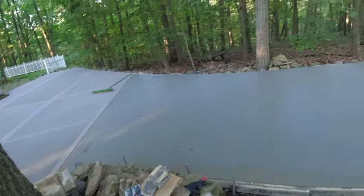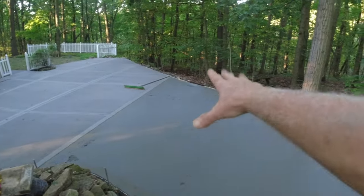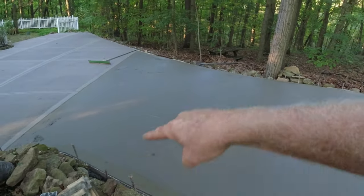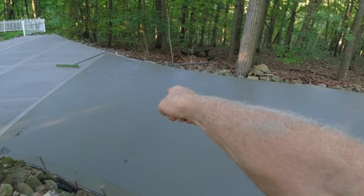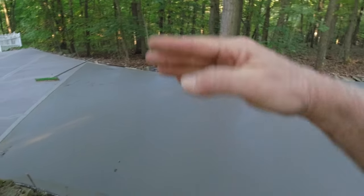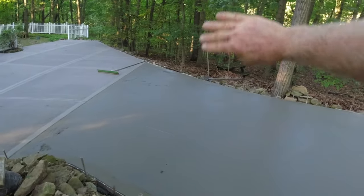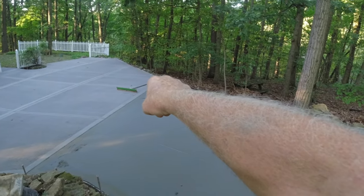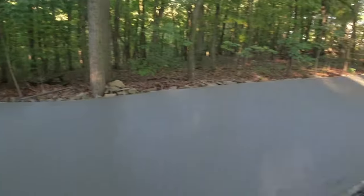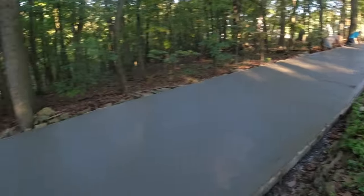Doing good. 8:30. Concrete's all edged. This big area, what we're going to do, we're going to angle this cut up to center with our cross cut, and then right at that intersection we'll Y it. That'll look like a nice design, and it'll give us good relief on all these little odd shapes in this long wedge. Over by the broom, that cut, we'll just continue that straight off, and it'll match 1 and 2 and 3 pads. These just get cross cuts all the way up. A couple minutes, we'll be on that.